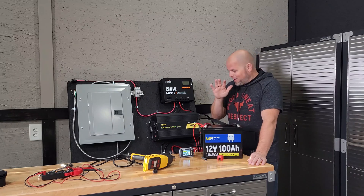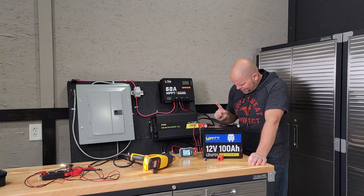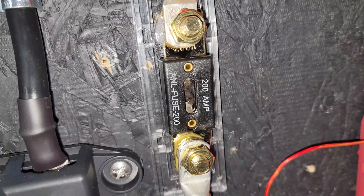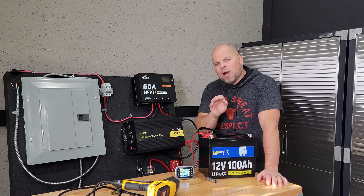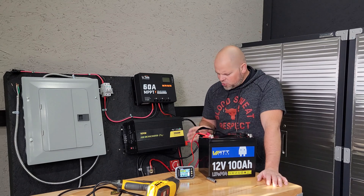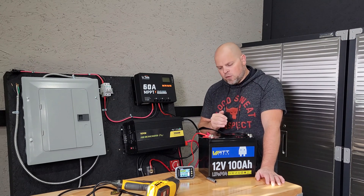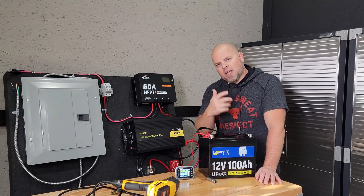That was a big scare. I thought the battery had burnt up my inverter because it was turning on but wouldn't come on completely. It turns out that the 200 amp fuse in-line had burnt out — but not completely. As I took the cover off and looked at it, you can see it's burnt but not completely burnt out. I was running at around 178 to maybe 180 amps maximum, and that fuse is rated 200 amps, so I'm not sure why that would have happened. Leave a comment if you know why — we were under the actual rating of the fuse. The battery and inverter are safe, so let's finish the capacity test.